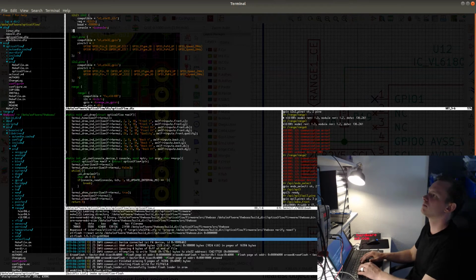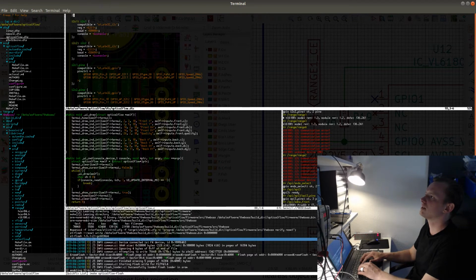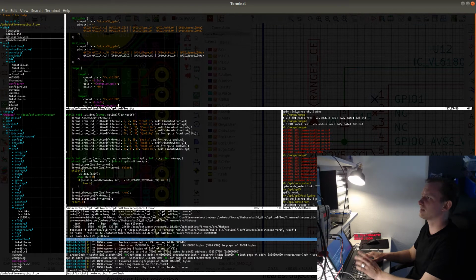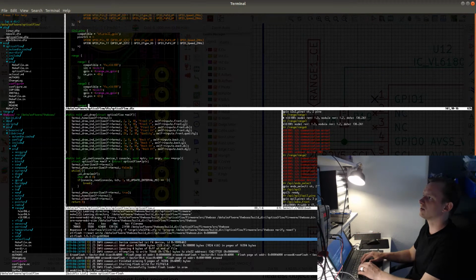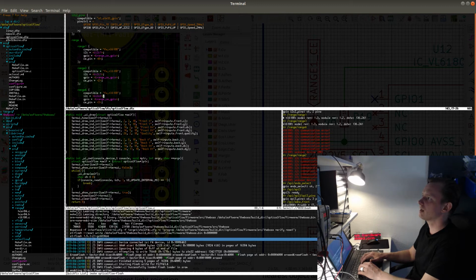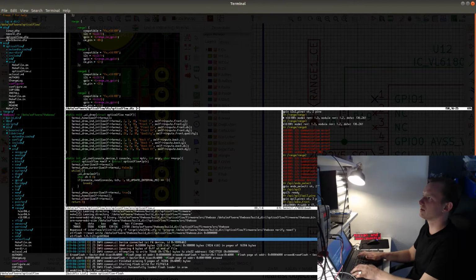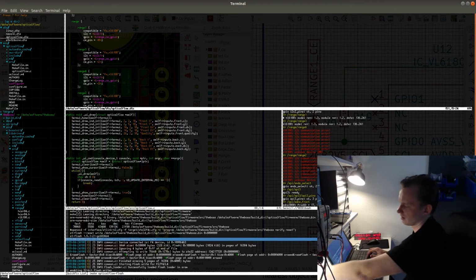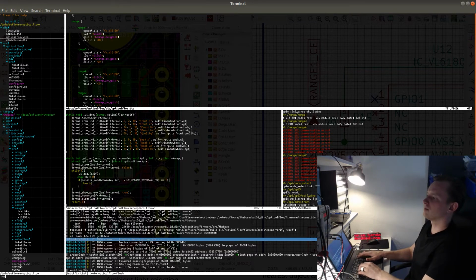So let's move the sensors from I2C. Actually I don't need I2C 2 anymore, but I'll still keep it there, because on the final board I will probably use I2C 2. But all I'll do is just rewire the 2 other sensors to I2C 1, and I'm going to rebuild the firmware. Let's see.